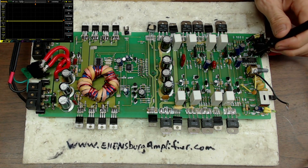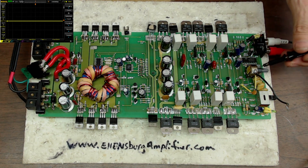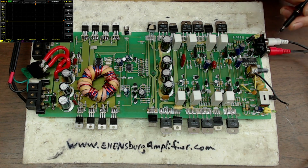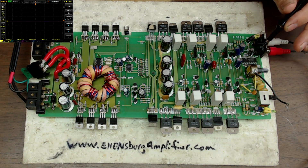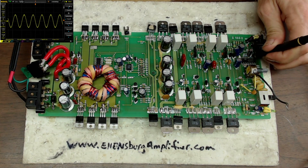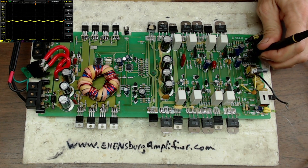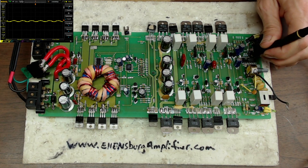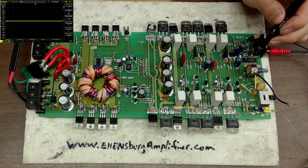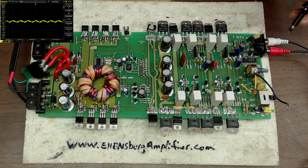I adjusted the resistance value of the feedback circuits. Originally they had 18k resistors in the feedback loop. I first thought of changing the potentiometer value, but you can't because full counterclockwise is zero ohms. So I knew I had to change it on the input side of the TL074. I put in a 200k resistor, which brought me down to about 200 millivolts per channel on the input signal, instead of the original 1.4 volts with the 18k resistor.